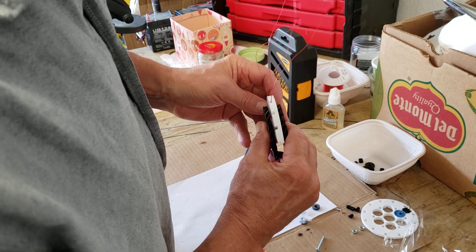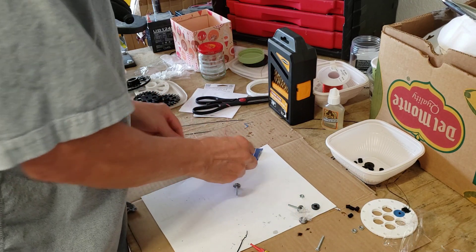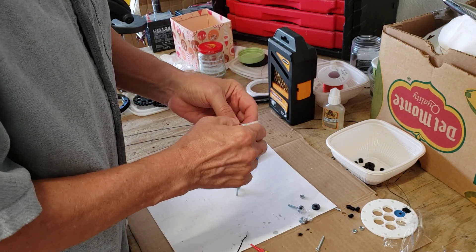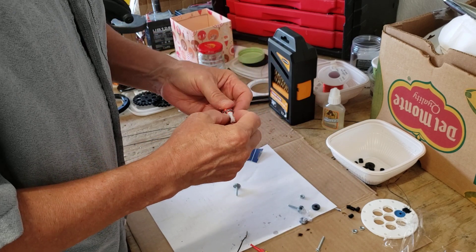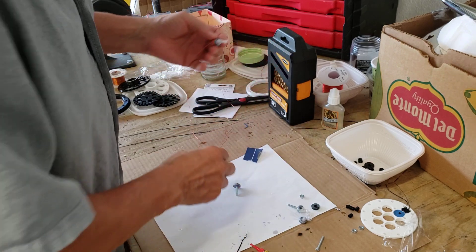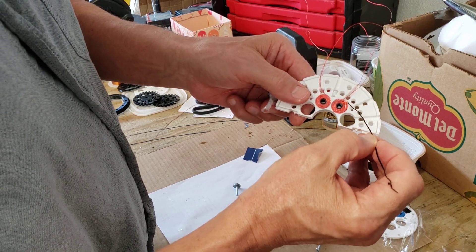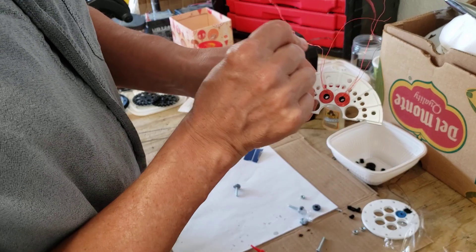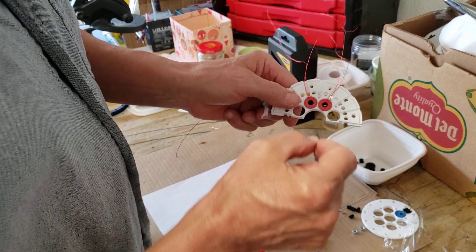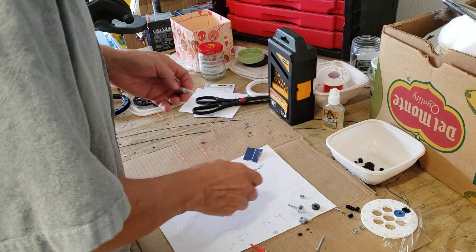There's a pretty good gap there. One key point is that they're all wound in the same direction, so you have an inside wire and an outside wire. They're all going the same direction. If I put positive voltage on the inside wire and negative on the outside, I know which direction the flux will go — on every one of them it'll be the same way. What I'll be doing is wiring these alternating so that they're opposite. We'll get into that a little more later.